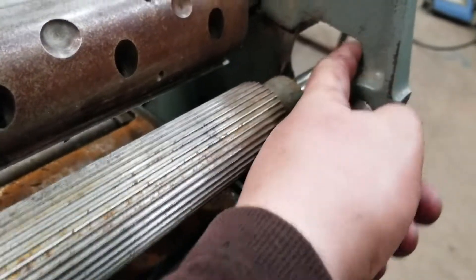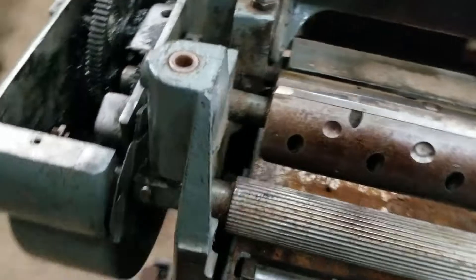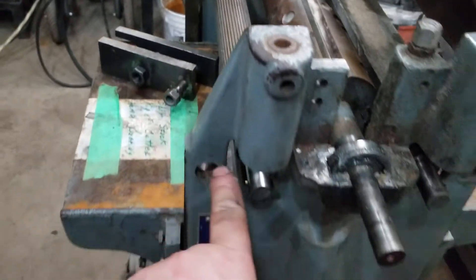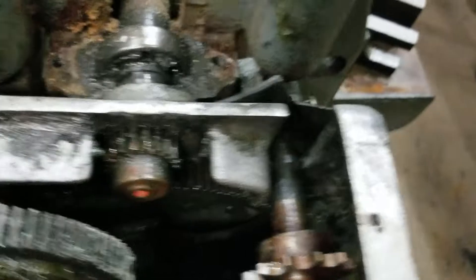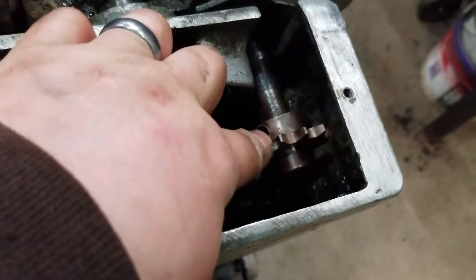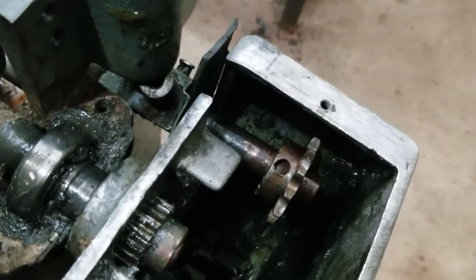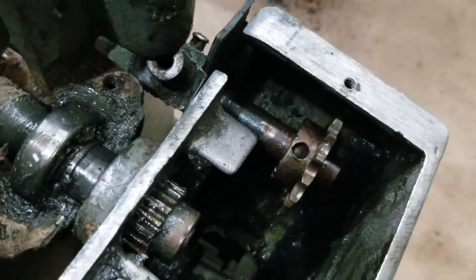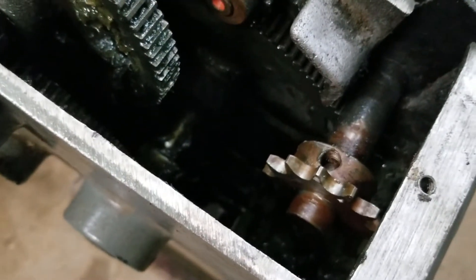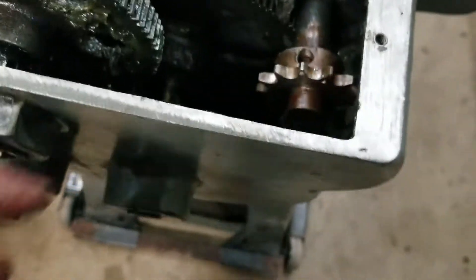The problem is that the roller goes through a cast iron block on the right and one on the left, so I can't lift it up or down — it has to come out this way. But I can't do that because the gearbox slot is tiny and the shield has only a three-quarter inch hole around the shaft, so this gear has to come off. Unfortunately, the set screw completely marred the shaft, creating a bunch of shavings. It wasn't tightened enough, so the in-feed roller gear stopped while the shaft kept going, totally messing it up — and now I can't press this gear out.